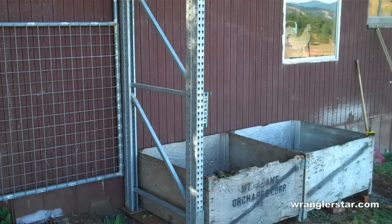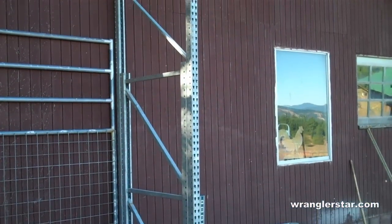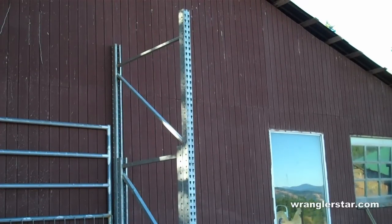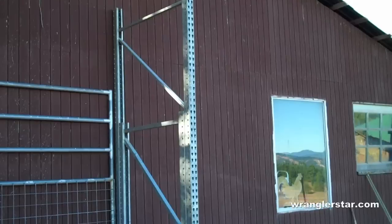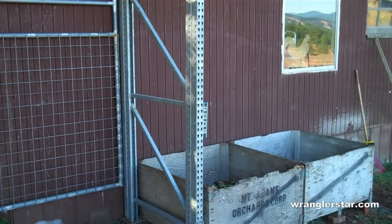I've thought long and hard about what is the best way to build a water tower. Obviously, water at roughly eight pounds a gallon times a thousand gallons is a ton of weight, so it needs a pretty strong structure to support that. I thought about timber framing or building one out of wood, and it's actually kind of expensive and a lot of work. What I came up with is this heavy-duty double-reinforced pallet racking — it's galvanized. I found it on Craigslist. It's really strong, galvanized so it'll never corrode, and it will be able to support the tremendous weight.